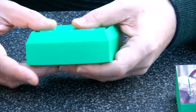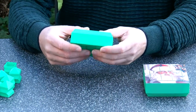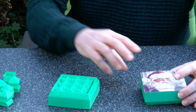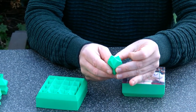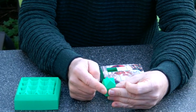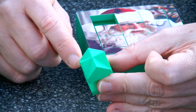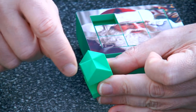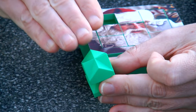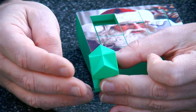I experimented with several other roof types, and the roof type that worked best is the roof type that you're seeing here. You can also recognize it with the Santa Slide — it's a roof type that has a cross. Because the circumference of the cross is always the same during the whole height, which means there is enough time for the plastic to solidify.